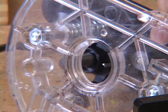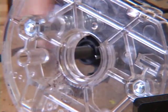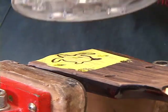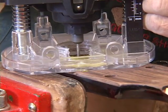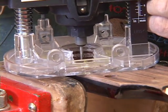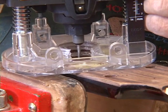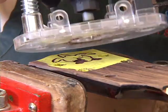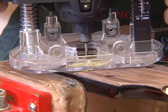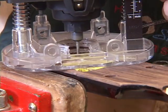After cutting out the outline, I use a 1/8 inch downcut routing bit to hog out the material within the outline. Again, slow and careful movements are needed to prevent taking more material than is needed. Stopping and blowing away the wood chips will give you a better field of view.